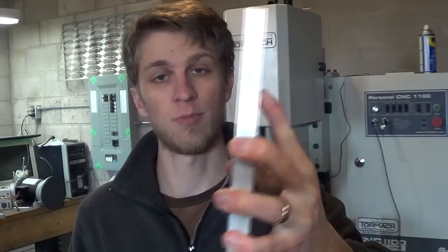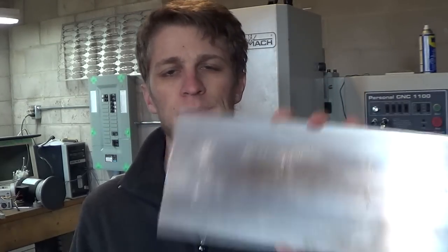I've known about these vacuum systems for quite a while but I've never fully understood all the capabilities. I always thought it was just for holding little weird stuff like this, but when you start thinking about my knife handles — they've got screw holes, lanyard holes, and a lock bar cutout — I always thought of it as just putting an O-ring around a handle and sucking it down, and I didn't think that would be good enough. It's not a lot of surface area. So it's not a good solution for milling out handles by themselves, but just the pallet changes by themselves are going to be wicked. Today's project for Knife Making Tuesday is to show off some of the awesomeness of the VacMagic system.